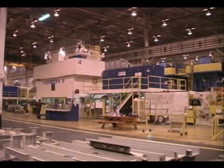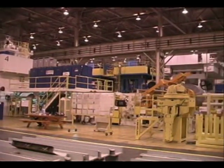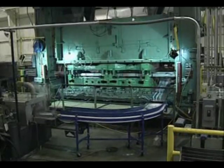There's also the vibration and also the impact to the press as far as how it's softening or possibly keeping the wear and tear of the press to a minimum over a period of years. In mechanical driven or electronic servo driven presses, the vibrodynamic pads long-term saves the wear and tear of the internal parts of the crown and any mechanical pieces that are on that press.